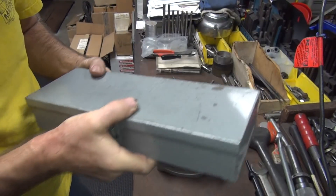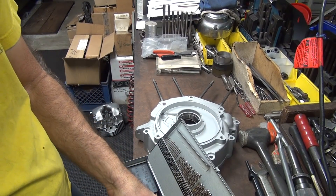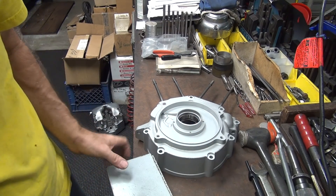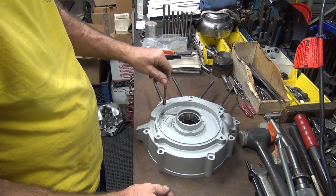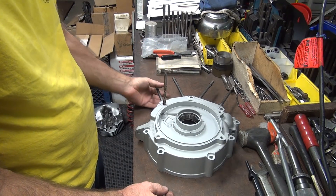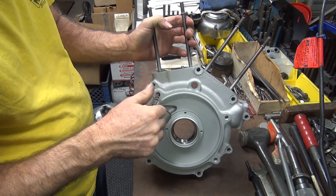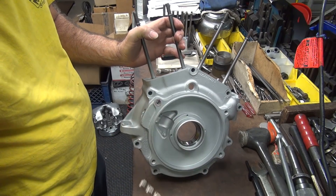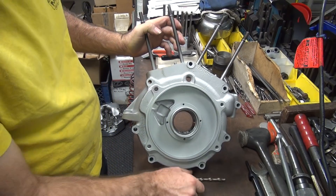Get the old kit out — it'll have one in there. So that goes in there and knocks out the threads. I don't know what that's going to knock out; it's already that size. That's not a good sign. That means that's bigger than 3/8ths — they stripped out 7/16ths. That's two sizes bigger in stock already. There's a 3/8ths.